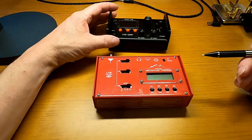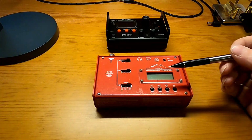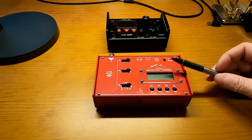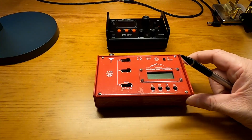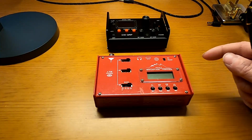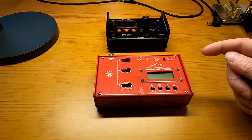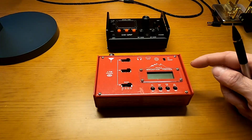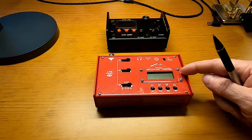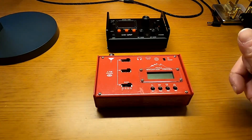So advantages, 4-band radio. How useful that is, I don't know. It depends on if you use 80 in the field or not. This radio has a real-time clock. It's got an SWR meter. It's got 3 different programmable CQs or message memories that don't even have to be CQs. I can directly enter my frequencies. It's very easy to change key speed on this radio.